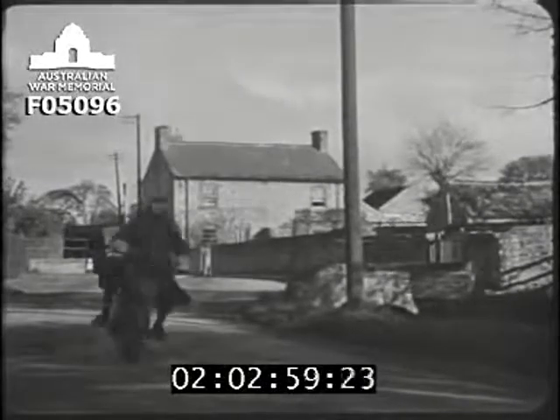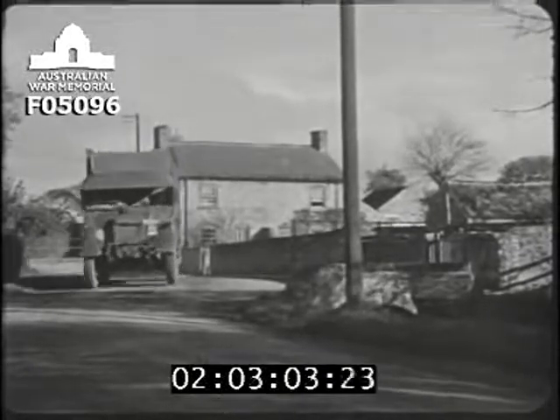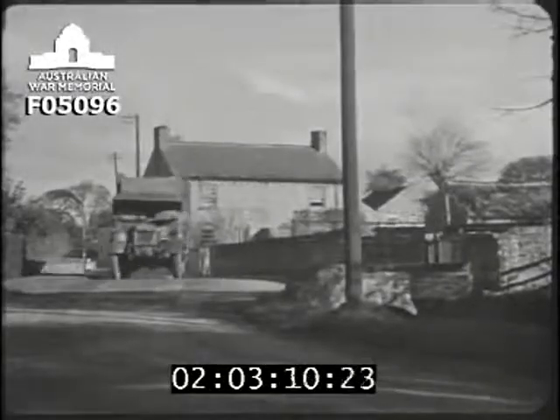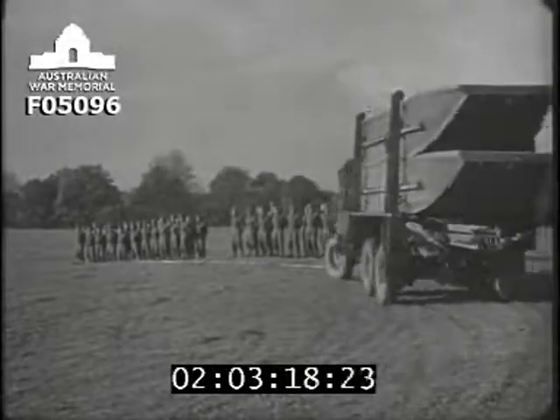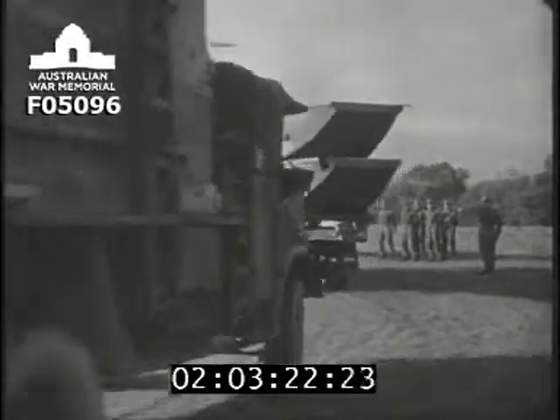The stores for the three-pair raft are carried on special pontoon lorries, each of which takes two pontoons and one third of the raft superstructure, so that three pontoon lorries are required for one raft. The lorries are driven to the offloading site, which is placed as close to the building site as possible and should be marked out with tape. Here's a suggested organisation for offloading — for clearness, no attempt has been made to obtain cover.